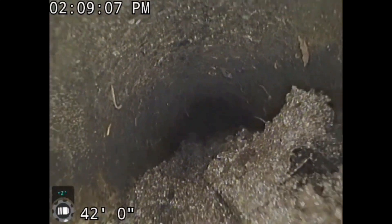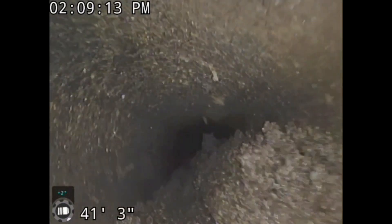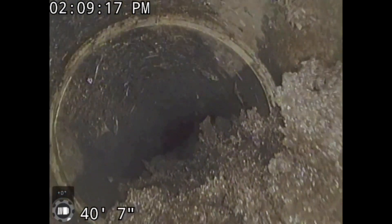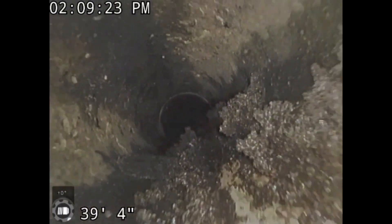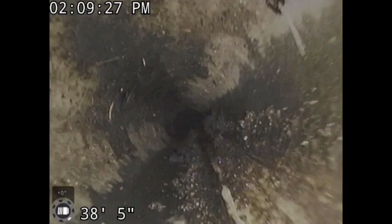That's your other option. This pipe, with its crack, there's probably some dirt also falling in. And once it hits that 2.5% slope, it's not pushing the dirt out, it's not pushing the shingle gravel out. Anything that it was carrying in the water, it loses. The water evacuates too quick — it won't carry the solids away.